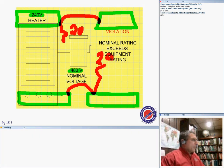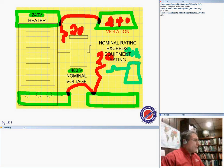When I was installing these 240 heaters, I didn't have five of them that day. So one little thing I forgot to do is connect one of them. Let's just say one was rated for 240, and I actually brought 120 to it. It was remodeling, so I had a big J box, brought the wires, and from the J box we went to a fully installed panel. One of them was supposed to be 240, but I wired it at 120, and guess what? The power coming out was 1/4 the amount of power or heat that this heater would have produced at 240.